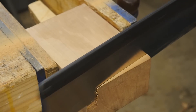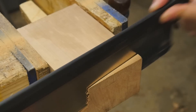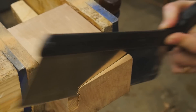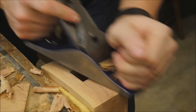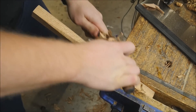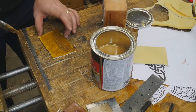It's a lot of going back and forth until it has a nice fit. Then I'm going to cut off both ends at a slight angle — making a mark at about three eighths of an inch at the bottom, drawing a line up to the top corner, and cutting it off at the bench, following that line all the way around for a nice clean cut. Then I can start shaping: use a low angle jack to shape off all the end grain, then a Stanley No. 4 to shape the top of the block. I like to give it just a little bit of a rounded shape so it feels good. Then a spokeshave to shape the handle, give everything a good chamfer, and make it feel good in the hand and look good.